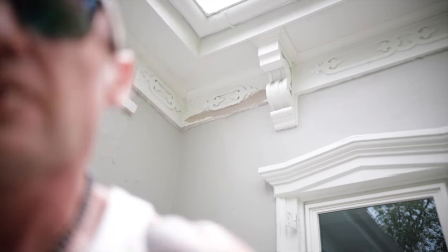If this were a finished area that really needed to be perfect, what I'd do before it hardens is take a wet sponge and gently massage everything perfectly smooth. That gets rid of small imperfections — the little holes, the tiny bubbles, the lines from your putty knife. But I'm not worried about that here. This is an exterior spot and it's not going to require any sanding. The way I've got it finished is fine for where it is — it's getting painted and it's done right. It's going to hold up for many years to come.